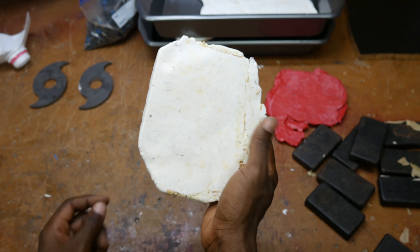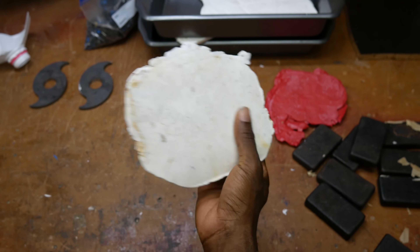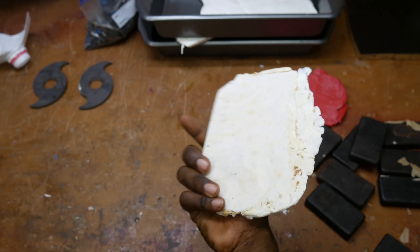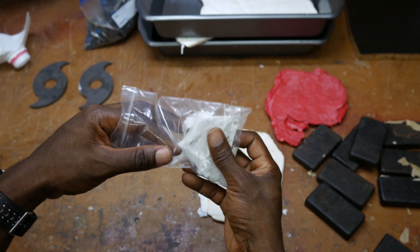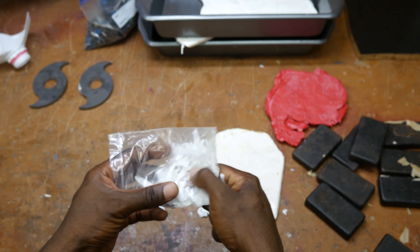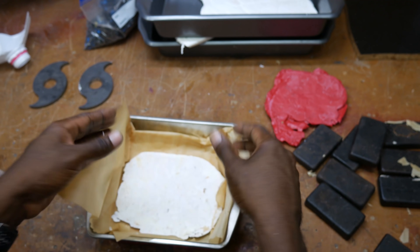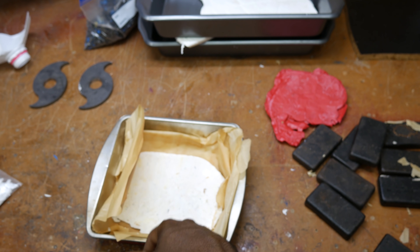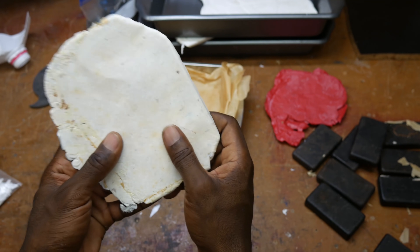The next one I'm most pleasantly surprised with is the plastic from the most recent shredder concept — I'm calling it a concept because it is not nearly done and needs a lot more work to make it safe for regular use. If you haven't seen that video, the material came out looking like long strands — many much longer than this — and then what was the equivalent of sawdust in the bottom, just plastic dust. I took all of that and dumped it in a pan following the same process, clamped it when I was done, baked at 350 degrees and left to cool overnight. And this is really solid and uniform.